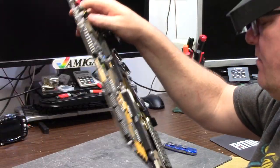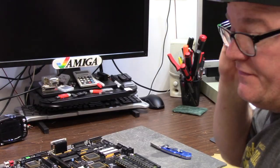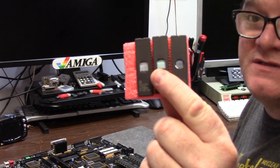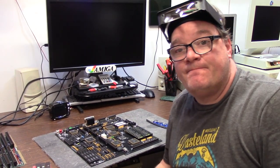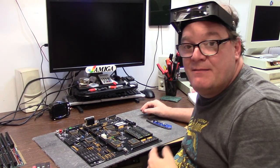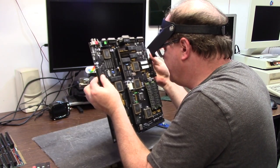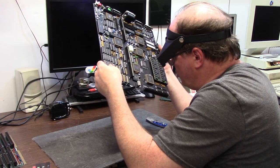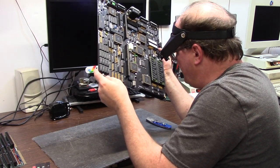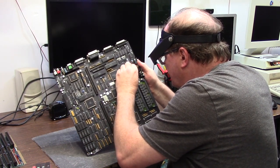Flux doesn't prevent working, that's no problem. First thing I'm going to do is I got some AM 27C400s from AMD — I'm going to write a set of 3.2.1 ROMs for the Amiga 3000, just to make sure it works, because I need them for my machine underneath. We're set for V-Sync, not TIC — interesting, I guess because it's using an aftermarket power supply. FPU is on external, CPU speed 25. I did get notice from John to just remove this jumper so I can use normal ROMs — I'm going to do that before I forget.